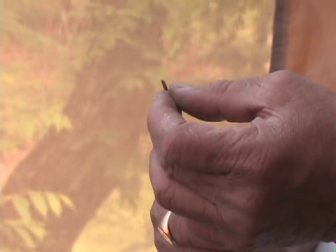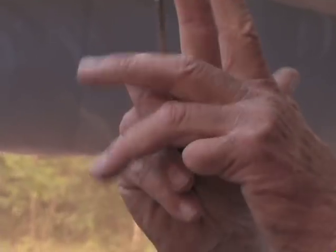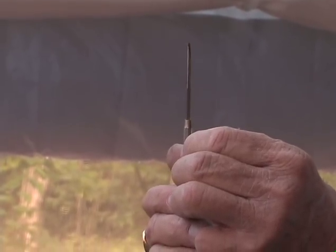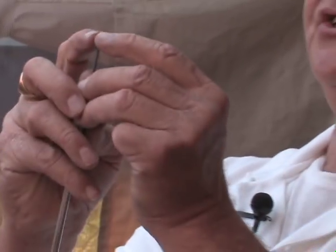And what you do, your tool, in this case, is just a Glendo blank, and then I've sharpened it down to come to a very sharp point, and then I've rounded the end, and the very end is the part that's going to do the cutting. So your corners are dull, you've knocked the edge off of the corners as you round it, correct? No. Sharp all the way along the arc. It is sharp all the way around the arc, about like so. Okay. But it's rounded on top. Right, it's rounded on top. And that whole nose or bull nose is very sharp.